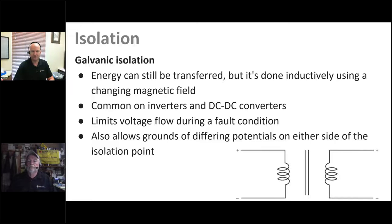In high-voltage systems — 600, 1,000, or even 1,500-volt string inverter systems — galvanic isolation is sometimes preferred for safety. Although less efficient, if there were ever a breakdown or fault in a device, an errant path could otherwise jump across high voltages through equipment that should not be transferring power. With galvanic isolation, there is physically no path for electronics to fault through — the transformer would break down and no conduction occurs, so it's viewed as much safer.